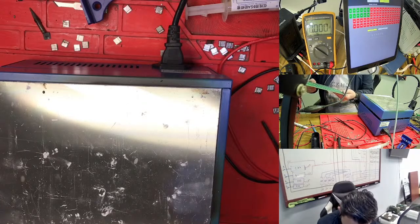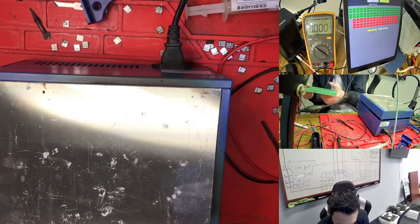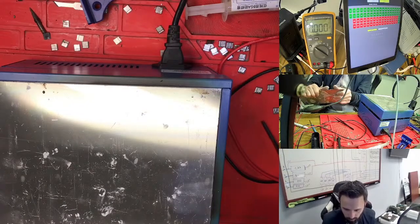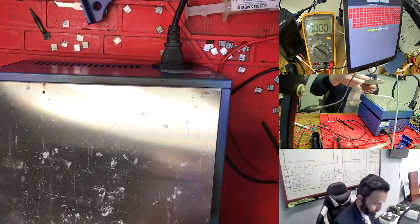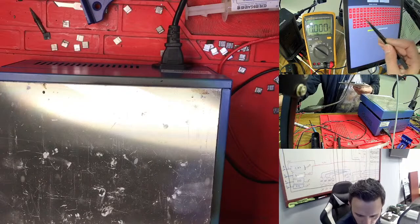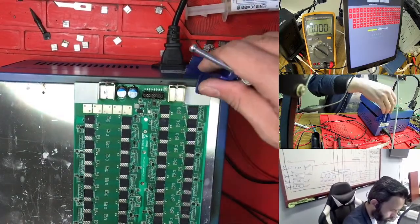So just 12. Where's 12? If I'm bending the hashboard, after then it is passing, so we need to bend here, which one, because it's the same like it needs a reflow, but sometimes you cannot reflow, so it goes back to 12. First of all we see the 12, so where is the 12? Maybe it's missing the soldering. 1, 2, 3, so 12 and the 6. First of all we go to the 12 quickly, we reflow the 12 and the next time we check again.